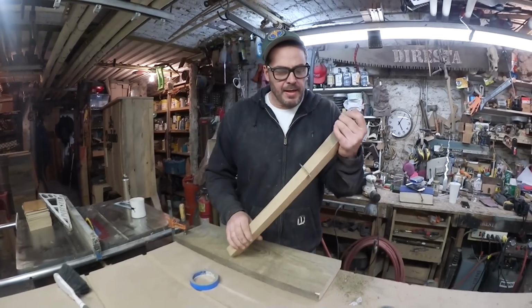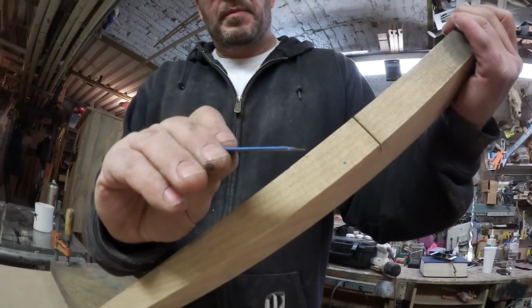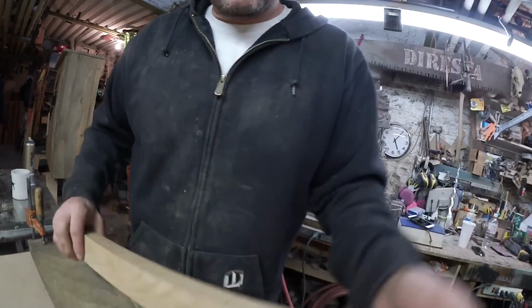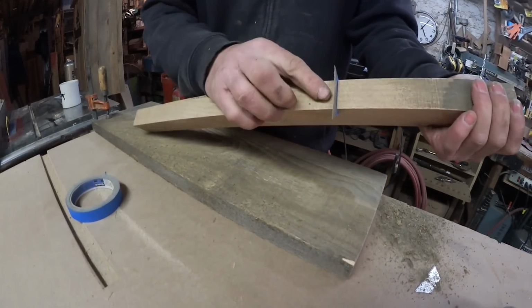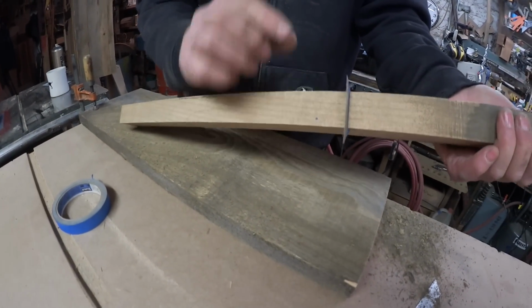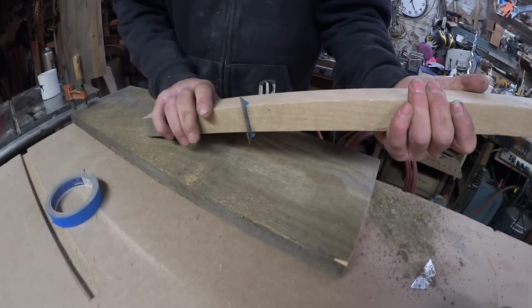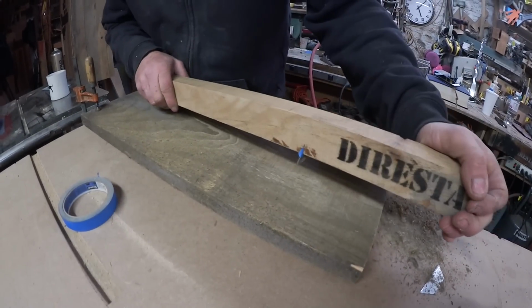Here's another trick. I take a razor blade and I put it in a bandsaw kerf. Use a little bit of scotch blue tape to take up the slack. And that stays in place, and I have a long board scraper. Since it's just regular razor blades, we could just throw them out and use them again. And if you turn it over, you get a resharpen because the burr rolls over. So try them one way for a little bit, and then flip them over and try the other way for a little bit.